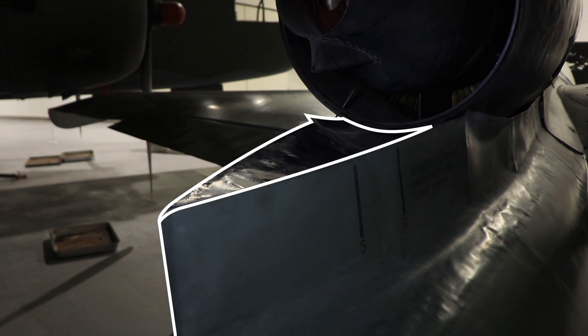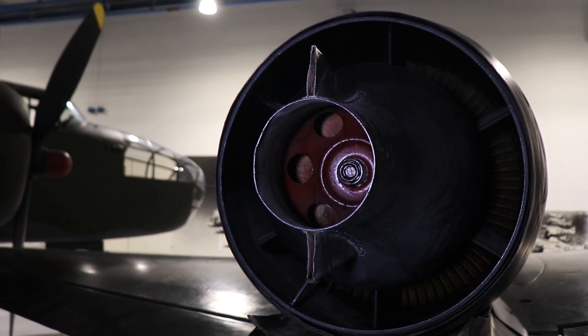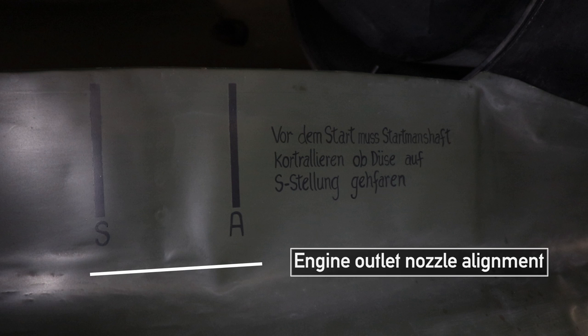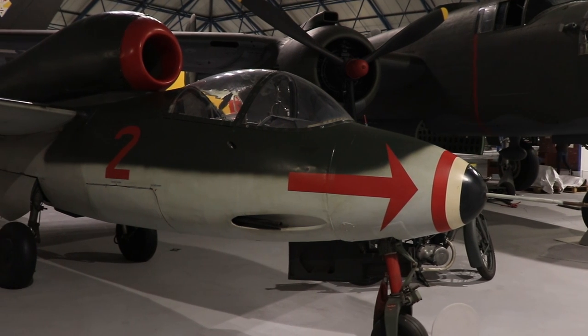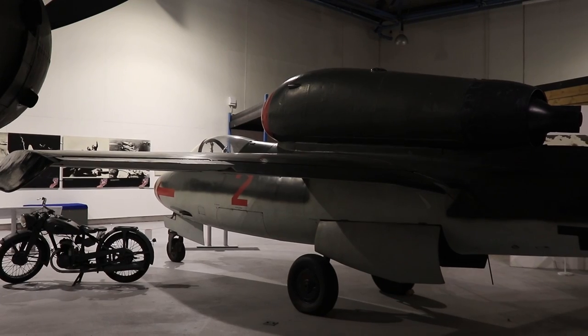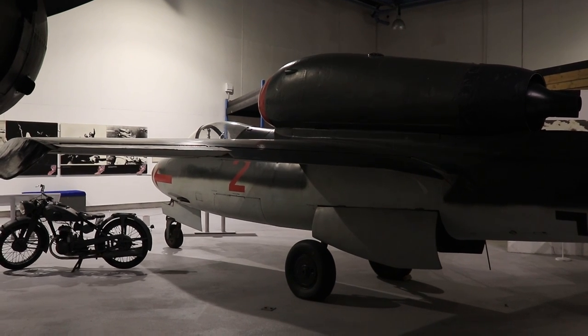Looking at the exhaust, we find an extended fence installed to protect the rear part of the fuselage. The exhaust itself has three variable settings, but only two are indicated: 'A' for starting and idle, resulting in a greater nozzle exit area, and 'S' for takeoff and climb, resulting in a smaller exit area — a third intermediate setting sits in between. The German text to the right is not original, as every German native speaker will have noticed, and features some spelling mistakes. While the plane was nicely restored to a static exhibit, there are various restoration-related changes from the original. I will say more on this at the end of the video.